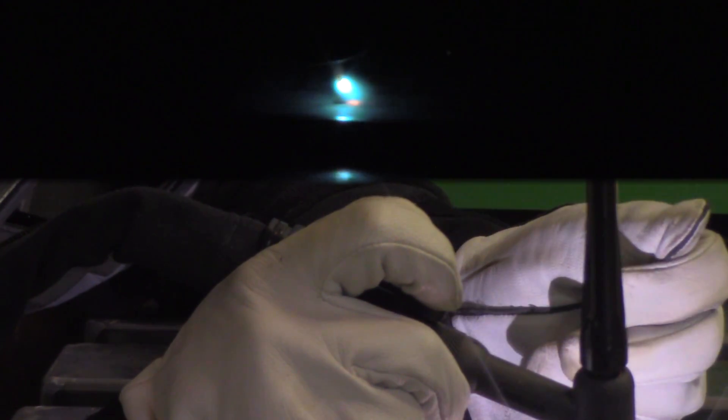I'll hold the trigger and I can move around freely because I'm on my starting amperage — it's not going to ramp up until I let off. Then it goes through the upslope timer into the welding amps and stays there as long as I want, at least until I press the trigger a third time, which brings it to its downslope and into its final amperage — a five-second downslope down to 3 amps. I can stay there until I'm done and let off the trigger again.